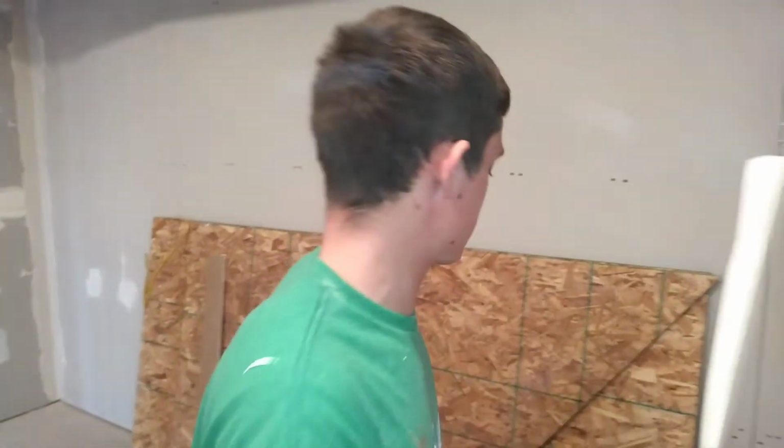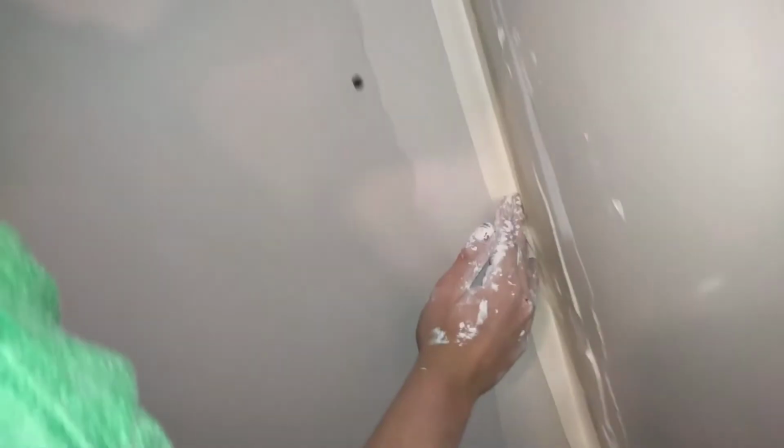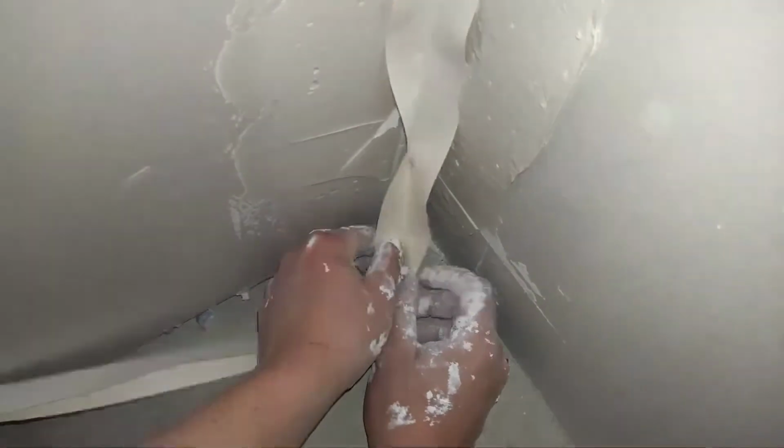Once you've done that, guys, what you're going to want to do is move your mud tray off of your bucket. Take it, stick it up to the top of where your mud ends. Take your finger, run it down there, push that stuff all the way into the corner. I'll show you guys how I cut this too. Make sure you get it all the way down and seat it right in there. That's how I cut it. I just kind of set it in there like that.